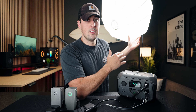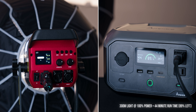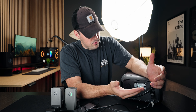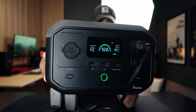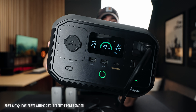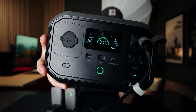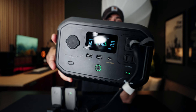Granted I'm only running a 60 watt light. If I was running a 200 watt light or more I feel like I would get a lot less hours left on the power bank, but if you do the math and you need to charge your batteries a couple times and maybe run an interview shot for an hour and a half, this could definitely be a lifesaver. If you unplugged the drone batteries and the camera batteries, using a 60 watt light at 92 percent you can get about 2.2 hours running at full blast. So just the drone batteries plugged in it's now saying 5.2 hours at 91 percent.